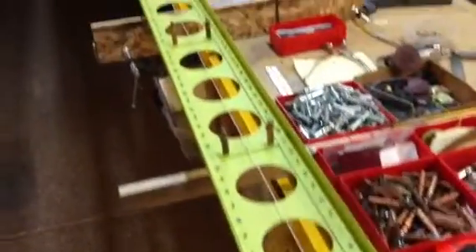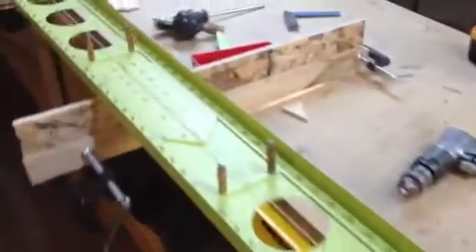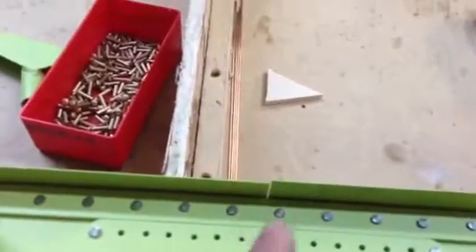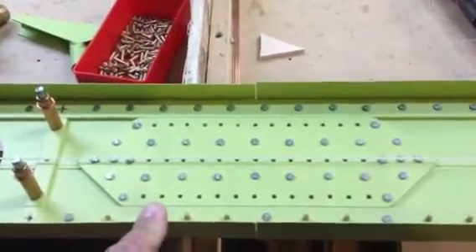So something to think about when you're riveting these spars: first of all, make sure you check for plumb all the time. A sixteenth isn't that big of a deal to some, but to me it's big enough to worry about. And if you find that you're out of plumb up and down, you can move the spar back into plumb by just riveting several rivets in a row together. So I went from about three feet either side of the splice joint — three feet either side — doing all those rivets across the top one right after another, starting from the splice and moving outward on either side. And it moved this spar a sixteenth of an inch and now it's perfectly true again.